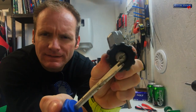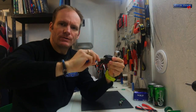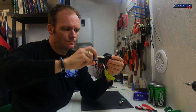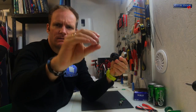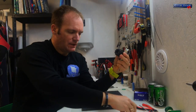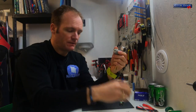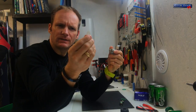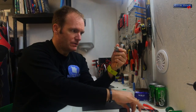Inside the valve you can see these two little teeth — they fit right over the bolt. When you hold onto the knob you can just unscrew this. Then you get your little retainer nut and a little spring — put these to the side. Sometimes there is also a little washer on this side. If you take the knob off, the washer is here — a little see-through washer. Keep that because it's not in the service kit. Keep the retainer and spring as well, because they're not in the service kit either.